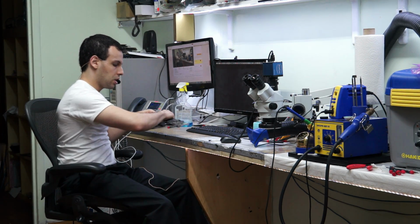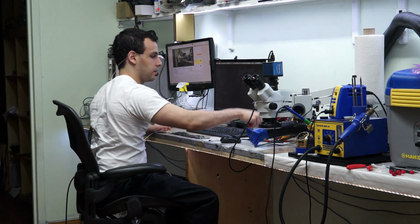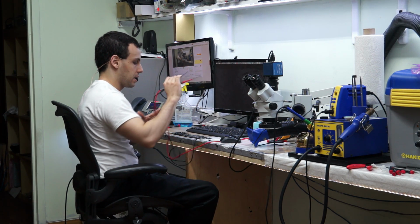and that orange light in the charger means that the PP3V42 power rail is working. As I've mentioned in other videos, the one-wire circuit is powered off of that power rail. So what I want to know now is why is this not turning on?